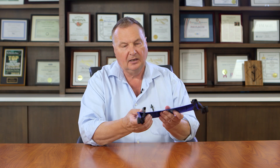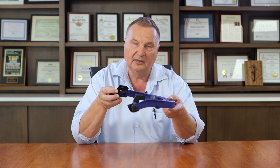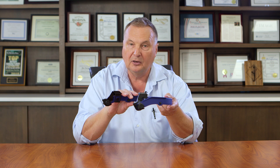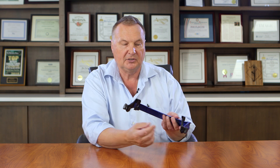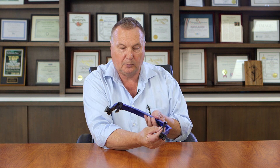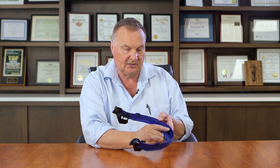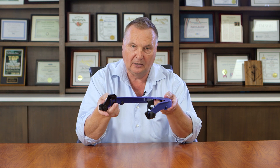For our weight compensating brackets, when you receive it you already have your own helmet — in this case the Bullard helmet. You receive the bracket and, if it's a kit, the face shields to go with it. This weight compensating bracket comes with helmet adapters, and you can see the press-to-release unit: snap it in, then press it and push up to remove it. The bracket has a lever lock system on the inside, with two attachment points that drop into keyholes on the shield; press it up into place and the lever lock engages the slot. This is the WCB-CSB bracket only, designed to fit the Bullard helmet.